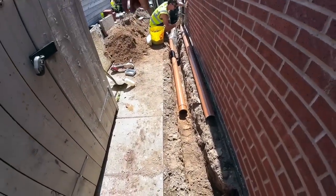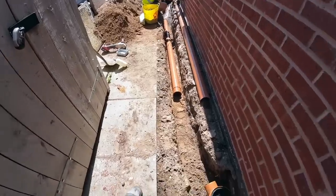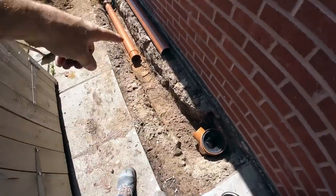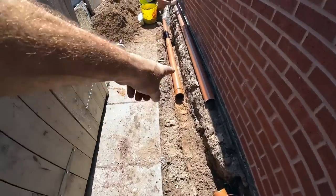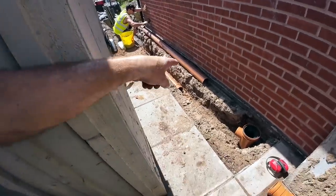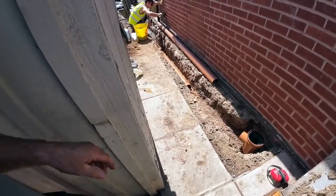Just a miscalculation here. Just needed three fittings, not two. So I just picked up a 15, I think. So I could put a 15 onto here, then drop it down to that straight up. Obviously, that pipe is lifting up without the wind. So that pipe is lifting up slightly, and that'll drop down into that. So I don't even need to check that fall.